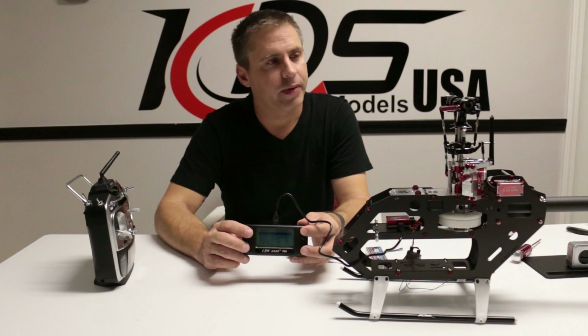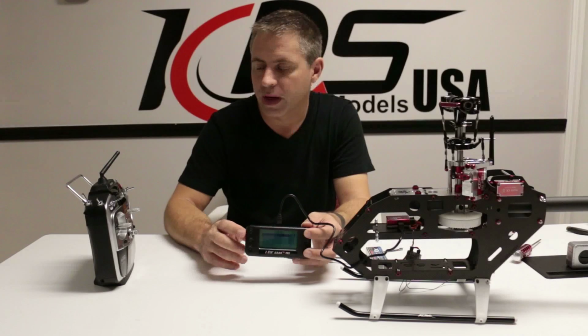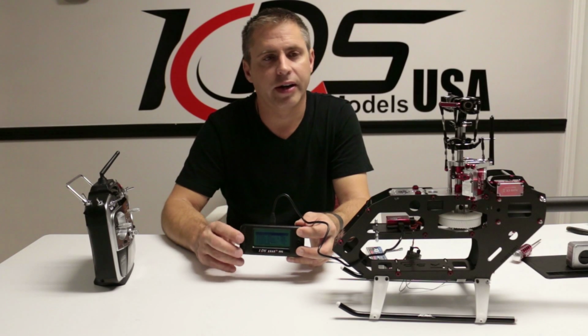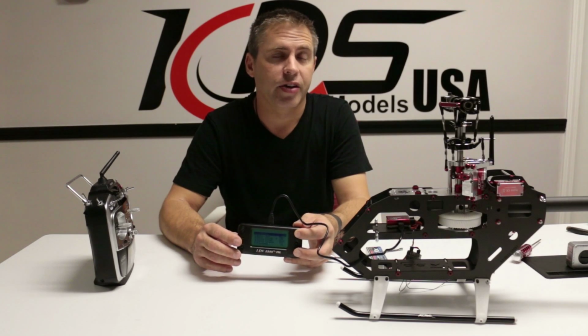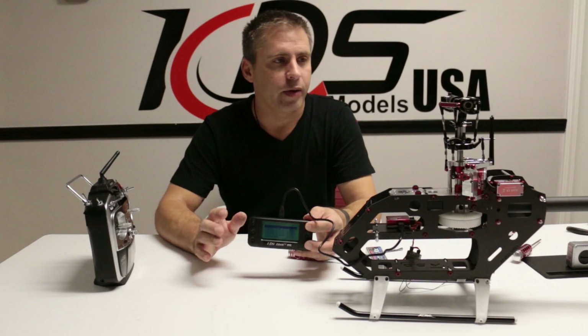We're talking about 1 degree. As long as my 0 pitch was perfectly 0, then what I would do is go into my endpoint setting on my pitch, and I would adjust the one that was too much to match the one that was smaller, and then I would be set.